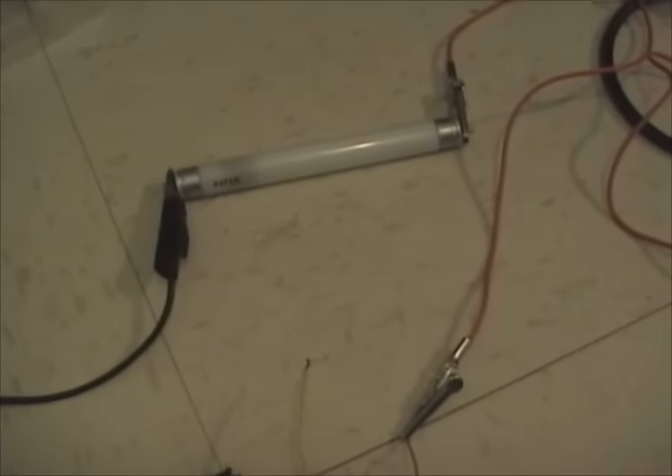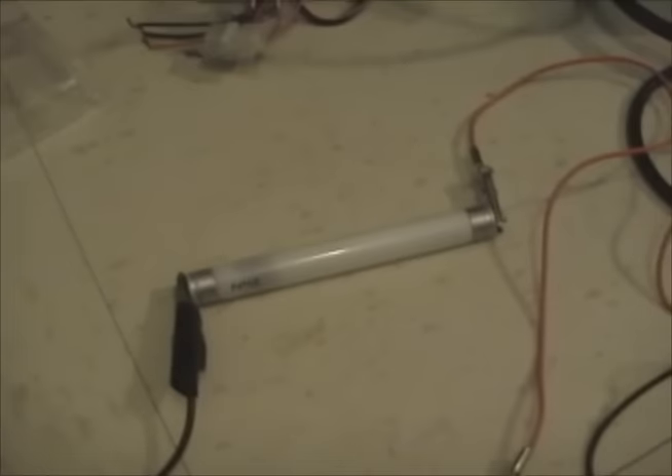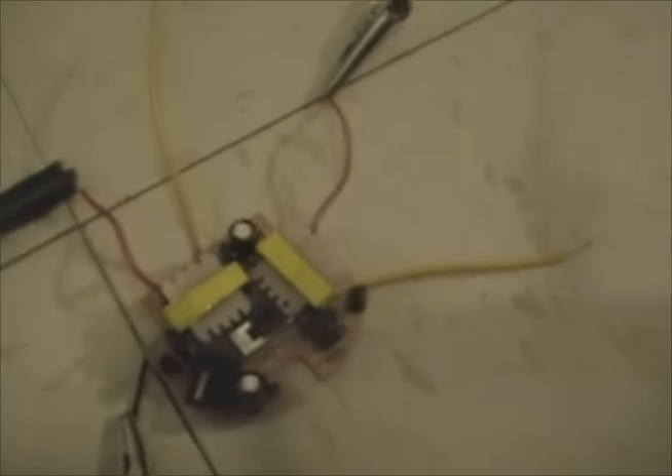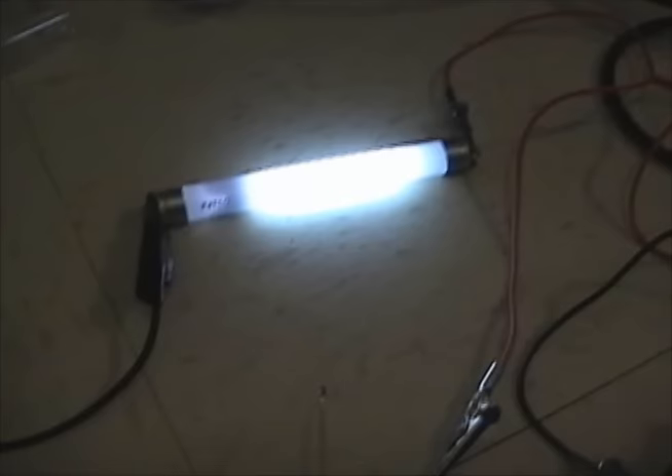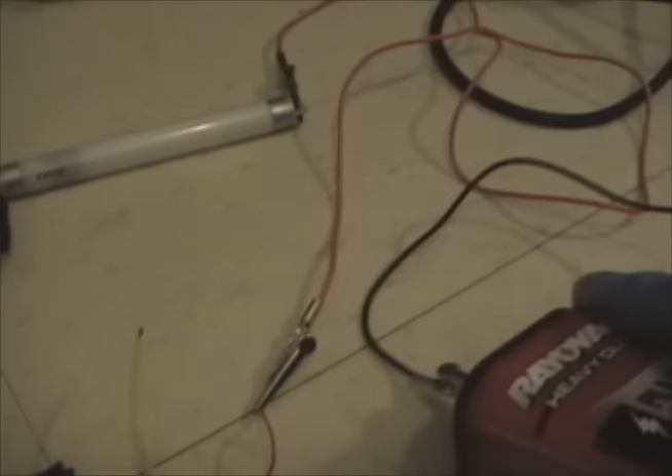Good news - it turns out the squealing noise was because I had the switch on the dual lamp mode and only one lamp hooked up, so the other transformer was crying because it was being turned on without a lamp. I've switched it to single lamp mode and now it runs great. In fact it starts up faster than I've ever seen it before - this was a really crappy ballast that ran horribly and didn't like to start. Maybe it's because of that 330-ohm resistor I put in. Whatever value that variable resistor was set to before, what I have there now helped it out. It works great - starts right up!